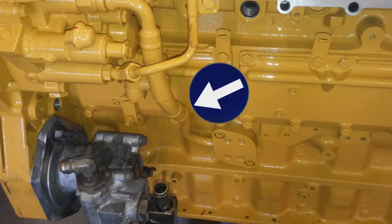What is this update? It's a truck engine news media letter, and that number is M0081390. If you go to a mechanic — even some CAT dealers — and ask them about this, they might have never heard of it. So if you give them that media number, they can bring it up in SIS and have all the parts and everything. What this update is, is an inline secondary oil filter. Where your HEUI pump gets its oil from on the intake side of the block, there's a hose that comes out behind the air compressor. When this hose is pushing oil into the HEUI pump, if it's got debris in it, it can send that debris into the HEUI pump. This is actually a screw-on inline filter that goes in place of your normal HEUI oil supply hose.